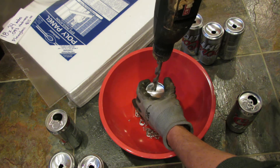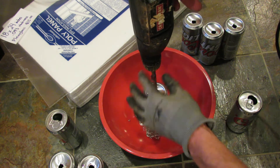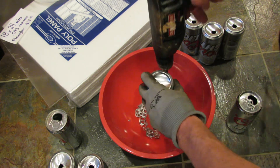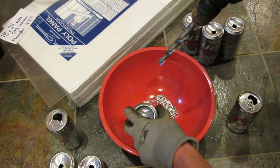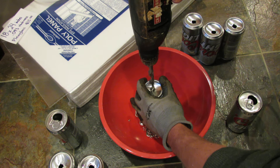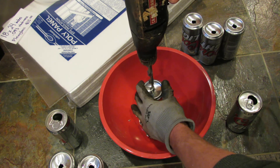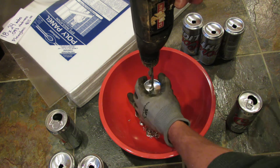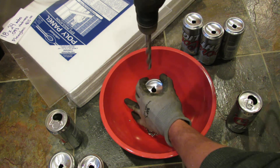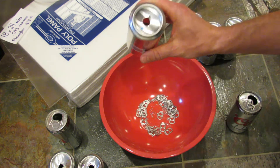When you do this, you're going to grip the can. Do not put a lot of pressure on the drill bit — you don't want to punch through and then go down too far and either hit the ground or hit the side of the can. Just gently turn it on and press just a little bit until you see the drill going in. As soon as it punches through, let go of the drill. Just like that, and you'll end up with a hole.